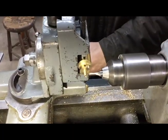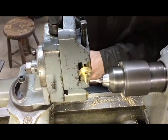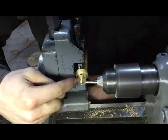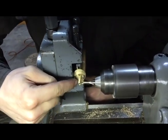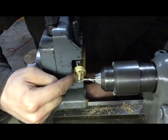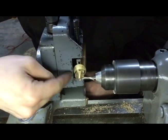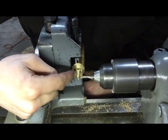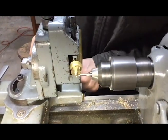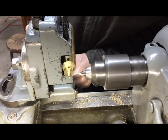This is the milling portion of the pipe elbow operation. You can see how we eccentrically turned a piece of round stock into a blank for a pipe fitting, so we could offset the male part of the pipe fitting and have more material on one side to make the 90-degree bend. We've now drilled a cross passage — it's communicating. We're milling down to carve out the shape of the pipe elbow, and then we'll use coarse files to get it to the final shape.